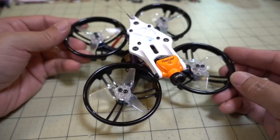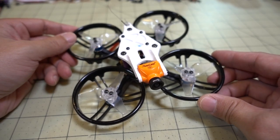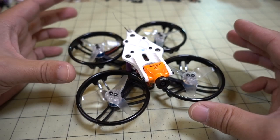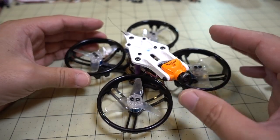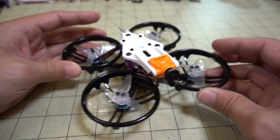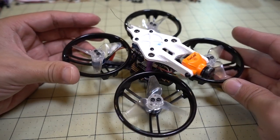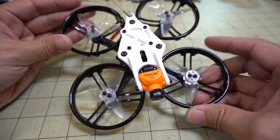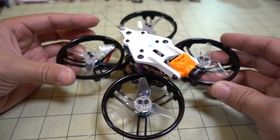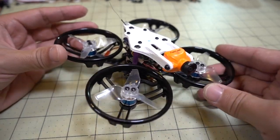The reason I kind of went with this project is I was inspired by some of the videos I saw from Shen Drones. He had a 3-inch micro with some pretty big prop guards, and he was actually running a GoPro on top — a really big GoPro. He was flying around slow, capturing HD video. I thought this might be interesting to do with something a little bit smaller like this one. I figured the 2.3-inch props is probably the lowest you'd want to go on this setup on 2S. It's fairly underpowered, but you're flying slow anyway and not really doing tricks, so it should be okay.